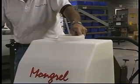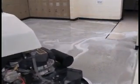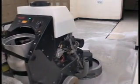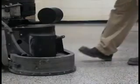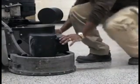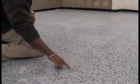Fill the onboard water tank with clean water. This allows you to keep the segmented diamonds cool during operation and also prevents paint or coatings that melt during the removal process from sticking to the diamonds. Add the full complement of weights to reach maximum head weight. Before you begin coating removal, thoroughly inspect the work area. Bolts that extend above floor level can damage or even destroy the segmented diamonds.